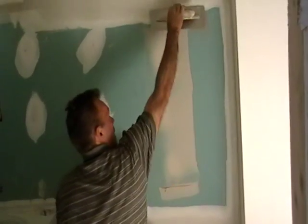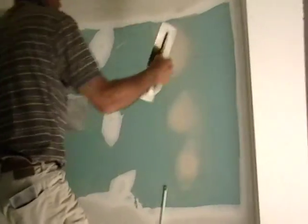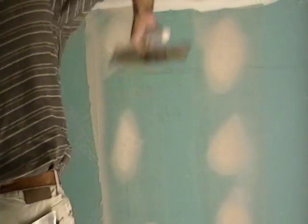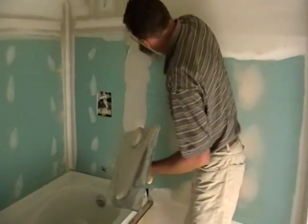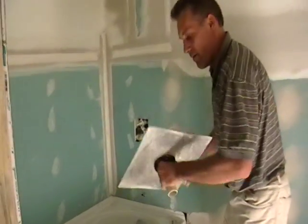This is going to be a pain, so we'll take that away. Go inside and I'll just skim the whole thing completely tight — there's nothing to sand there, or very little to sand. Next one the same way: push hard, push hard to the other side. The last two are inside the shower, but I like doing this so I'll just do it again. Load up my mud, push hard, keep it down, then it's nice and smooth. That's very, very thin.